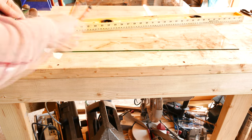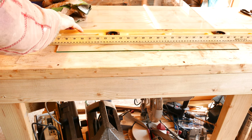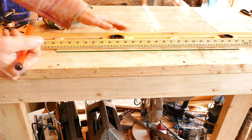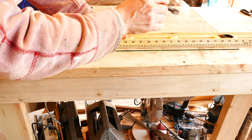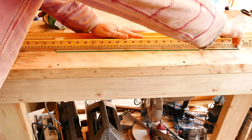To make life a little bit simpler, I've got a workbench here with a couple of screws that allow me to press this rule — or this spirit level — against the screws to keep it steady while I score a tight line against the glass. Try and get a good cut all in one go. If you miss a little bit, don't move the rule, don't move the glass — just score again and make sure you've got one contiguous cut. There's a bit of a rebate on this cutter, so I made allowances for that where I set the rule.